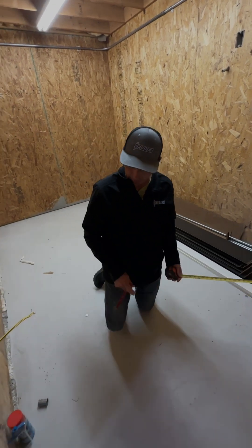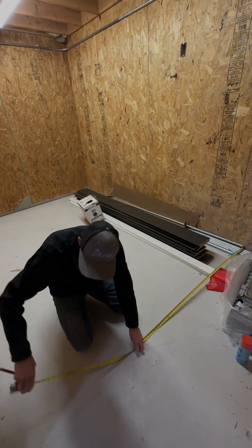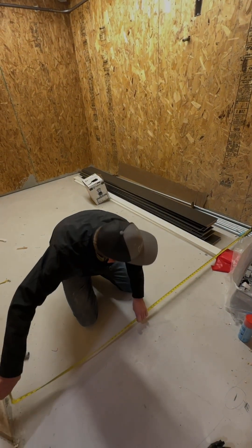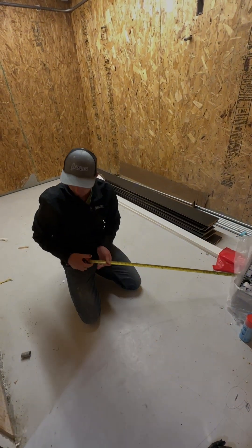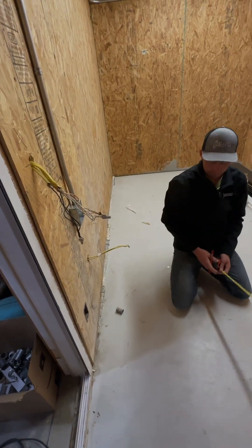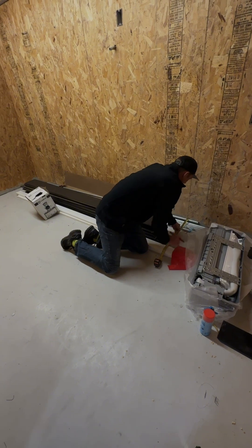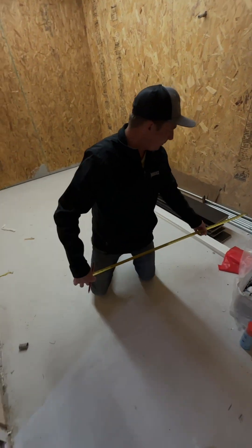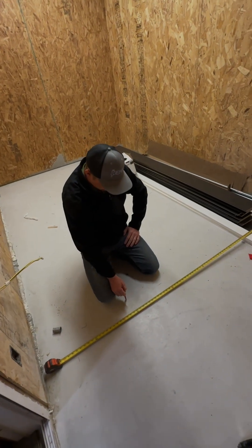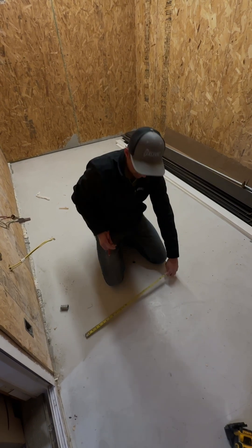I've got a lot of stuff sitting in here, which happens in construction. I'm only going to have two rows. I need to come in with my eight inches for the cloud plus two inches for the hat channel, and we're 77¼ inches wide. Two feet seems like a long ways — let's see where 18 puts us.